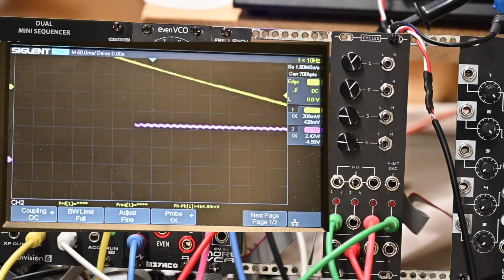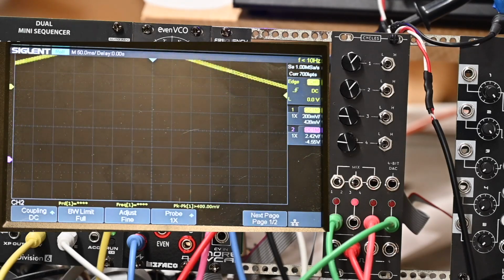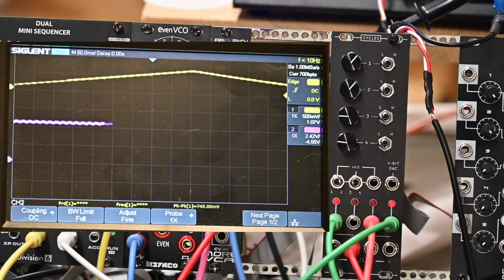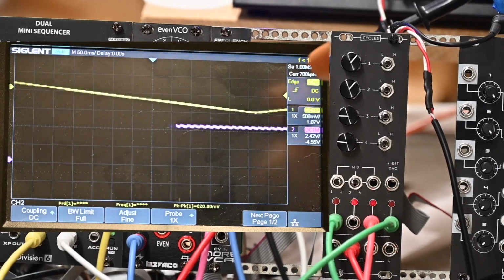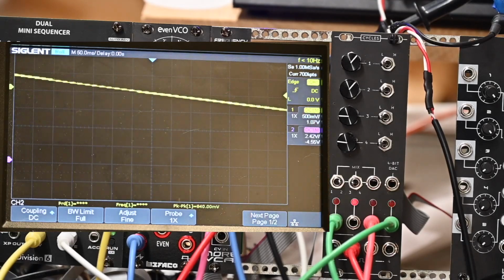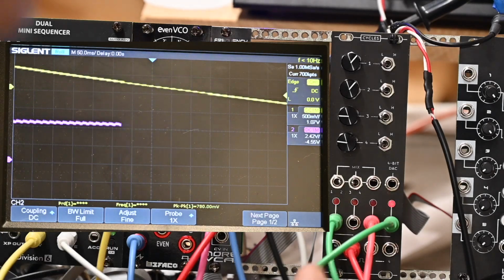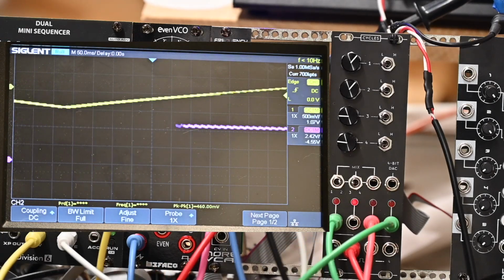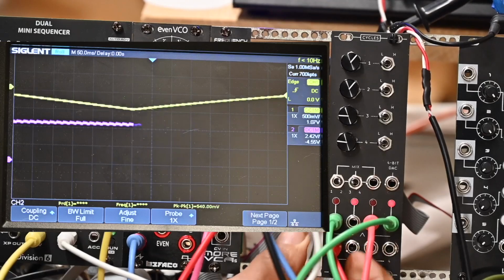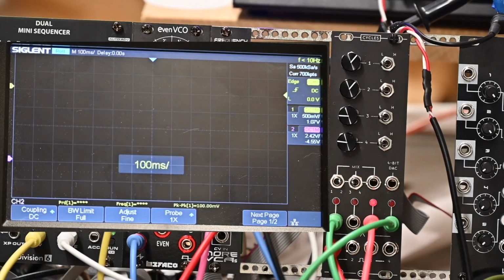And let me bring the scope up, and as you can see, I'm going to reduce this a little bit. The scope is outputting interesting things. Number 1, the top line on the oscilloscope is from the triangle output from LFO1. The bottom is from the square wave output of LFO2, though I'm going to switch that around and make them both off LFO1.